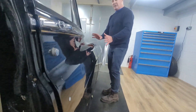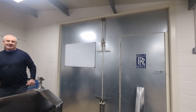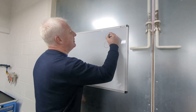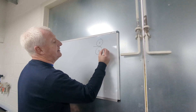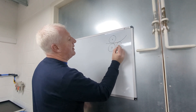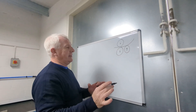So this is where I've got the problem: what do I do? If I can't find the rollers and you can't buy them, then you've got to make them. I've come up with this idea. Conventionally you have the pinch bend rollers — a roller here and a roller here which pinch together, hold your material, one goes that way, one goes that way, your material goes in between. You've got another roller that moves up and down, and the further you move that up, the deeper the radius gets, so you can turn it into a circle or whatever you want. But I don't need to do circles and tubes like that.